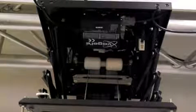With the broken optical sensor, the lift will only move for one second. It will stop and the LED will blink four times. It is easy to check, then do a reset of the LED by pushing the stop button for 10 seconds. The LED will then stop flashing.